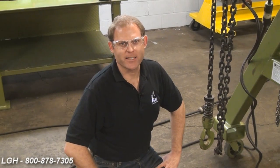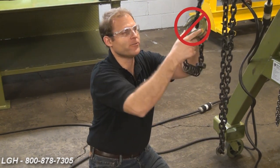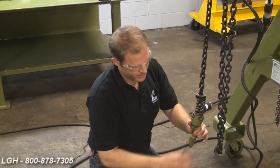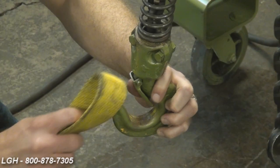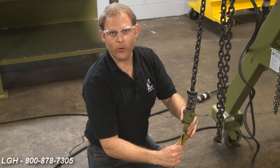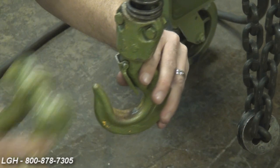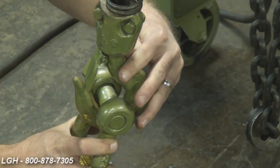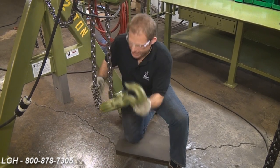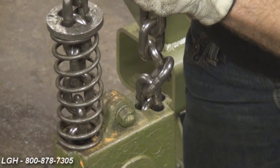Before we finish up, I'd like to remind you of a few safety guidelines. It's important to never use the hook and the chain as a sling itself, as doing so can cause deformation of the hook and damage to the chain. When loading the hook, it's important not to point load it — the hook is engineered and designed to deform to prevent overloading and catastrophic failure. As a good alternative, choose a piece of hardware that can safely rest at the bottom of the hook. On multi-chain blocks, make sure you don't capsize the hoist block itself, as doing so can cause kinks in the chain.